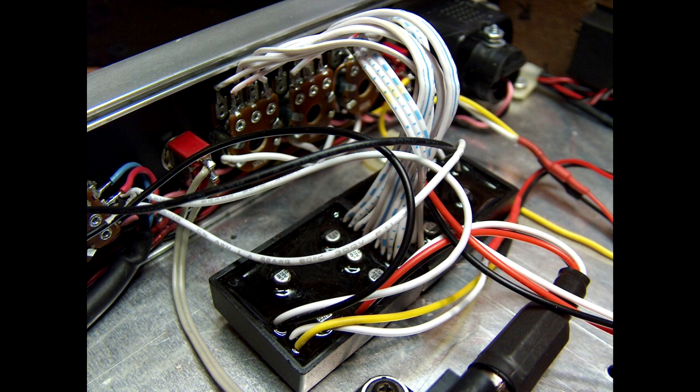What I did was wire them together where each pot, each frequency band — bass, mid-range, and treble — a treble wire would come out and go to a single pot. I would unsolder that and get a stereo pot or a dual pot, then take the pair of wires from the right and left channel and wire up that pair to a single stereo pot. That's how I made that happen. This is not a gainy all-tube tone Marshall machine of tone — it's just something to power the speakers. I get all my gain elsewhere.